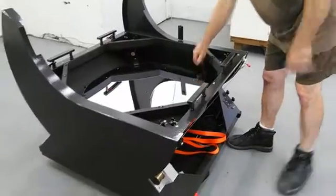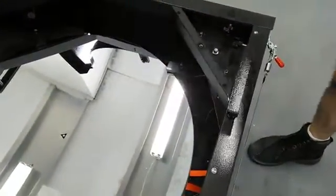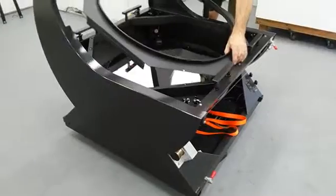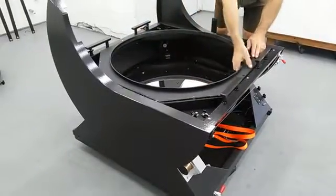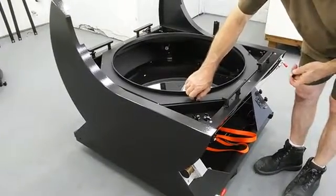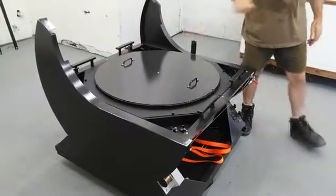I'm going to go ahead and put the clips over the mirror. You can see how far these clips come over — they should always be over all the way during transport, but when you're viewing, if you want to see a little less clip, you can just turn the clip so it's just covering a small part of the mirror. With the mirror in properly, I'm going to put the octagon top plate back in, carefully until it drops down, then put in the four thumb screws. It's always a good idea to put these in loosely first to make sure everything's lined up. With the top mirror plate secure, put in the top cover. You never want to do any assembly with the mirror exposed.